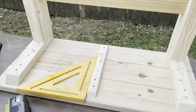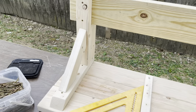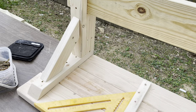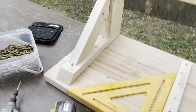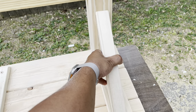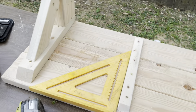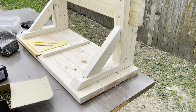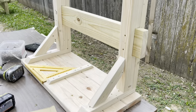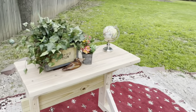My cleat is in place, but I did forget about these — these are our little corner braces. I wouldn't say they're purely decorative. They're not necessary for the desk to be strong, but they do technically add a little bit of extra strength. I'll go ahead and use my pilot hole and go in with some two and a half inch screws, put those top and bottom, and then our desk assembly will be complete. It definitely adds more of a farmhouse touch to it.